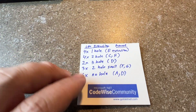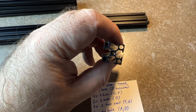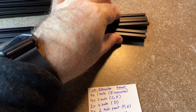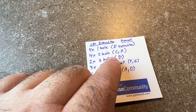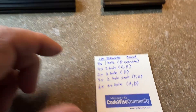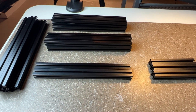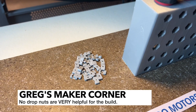The reason you have fewer extrusion types than what's in the manual is that all the extrusions are going to have the M3 tapped at the end. In the manual some two-hole extrusions have a tap and some don't, but from a manufacturing perspective it's easier to just go ahead and tap everything.